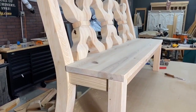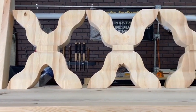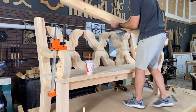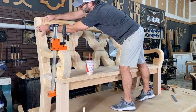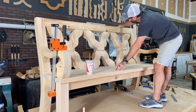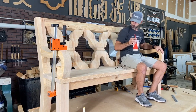I'm really digging this build — it's my most favorite build I've ever done, and it's coming out really cool. The armrest was a little tricky to figure out. I attached it with lag bolts from the rear, then had to undo the seat so I could lag bolt it from underneath as well, before reinstalling the seat. It's very supportive, very strong, and this thing is going nowhere.